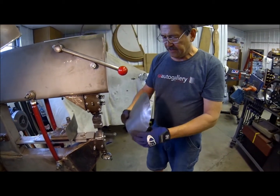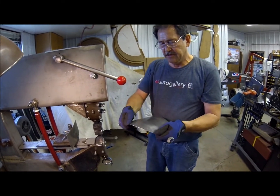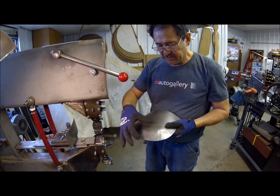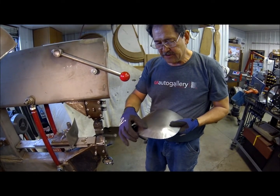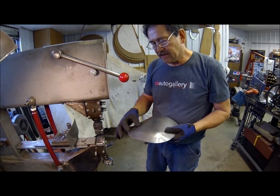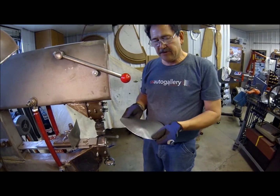There you can see already the metal is starting to pull down around the perimeter as it starts to do the shrinking. You have to vary your shrinks — some of them deeper into the material than others. The combination of more shrinking on the edge and a little less as you work inward will create that crown shape that you're trying to achieve.